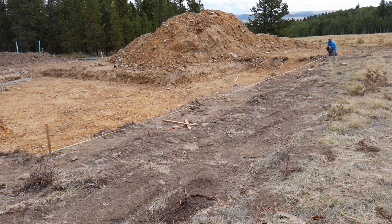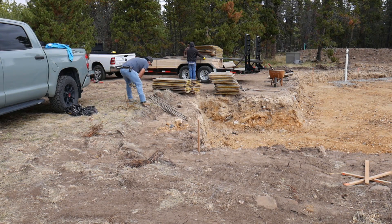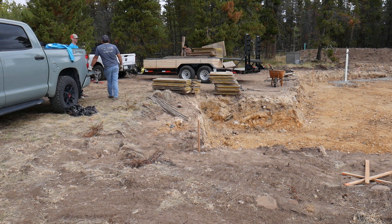The most important part of starting to form a foundation is triple-checking your excavation area. I'm verifying what the excavator has done since I was last on site to make sure we have enough room to build our foundation. Excavation sites are over-excavated — wider than the actual form dimensions — which allows us to work around the forms. Get everything unloaded, prepped, and placed where it needs to be: forms, rebar, stakes, etc. Get it all lined up ahead of time so you're not moving it more than once.